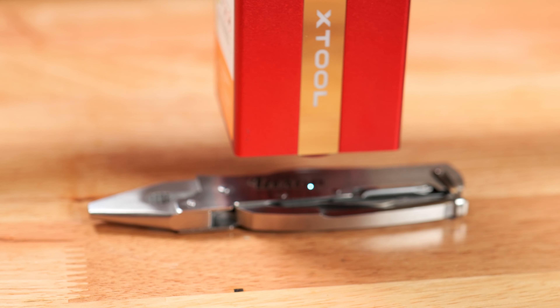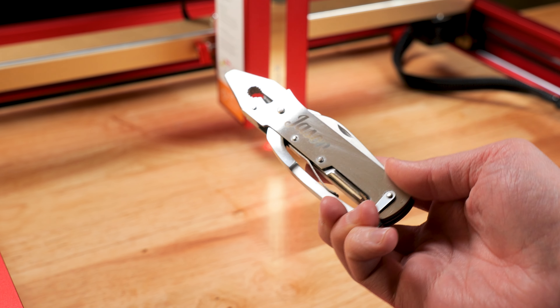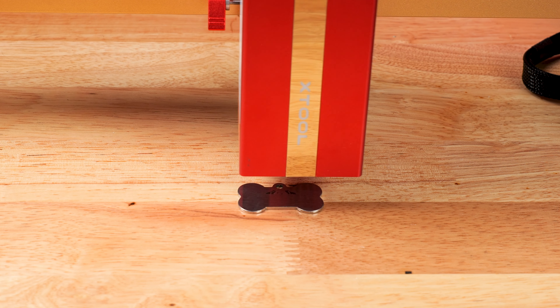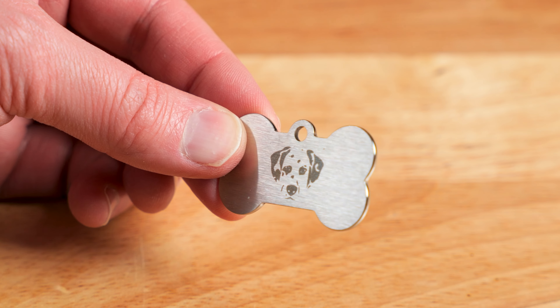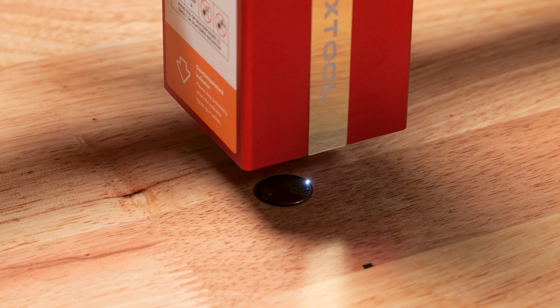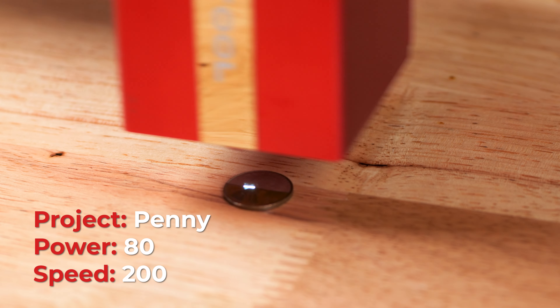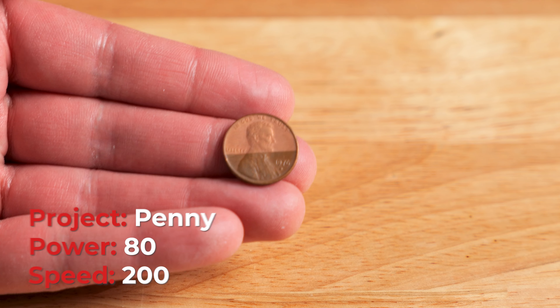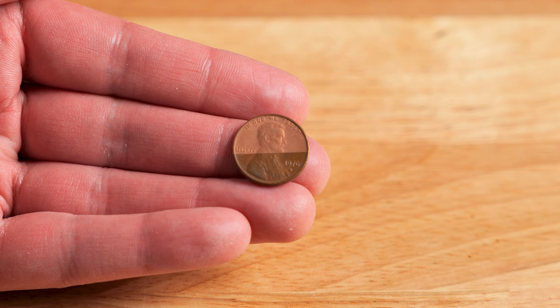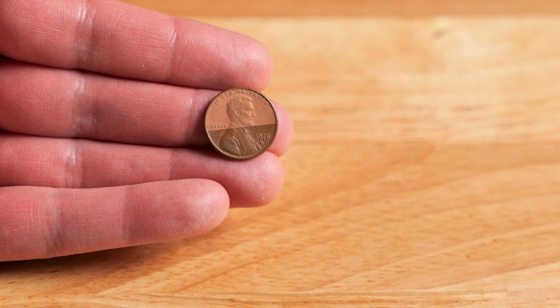I had a cheap multi-tool laying around so I decided to engrave that as well — it's looking pretty good. I also engraved a pendant for a dog necklace, which turned out pretty good. Now for my favorite part: cleaning a coin. I placed a penny down with settings too high and too slow and actually ended up burning it, removing some metal. After bumping my speed up to 200, it turned out fantastic. I did half of this 1976 penny and it turned out perfect. I don't recommend engraving old collectible coins since you will destroy their value.